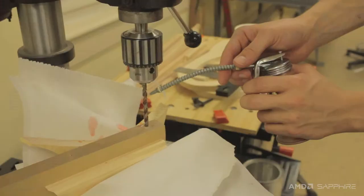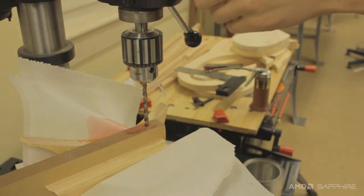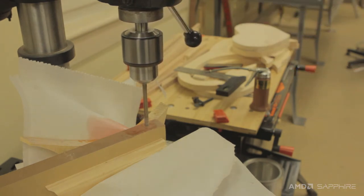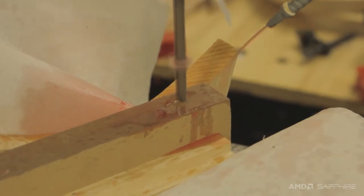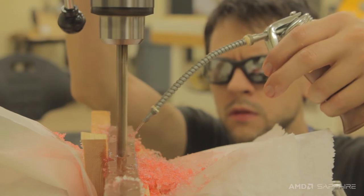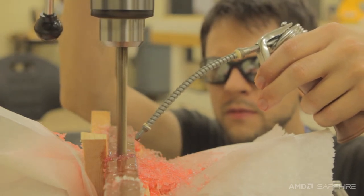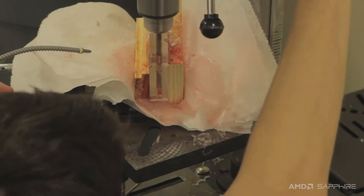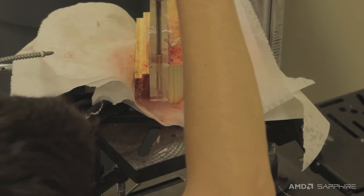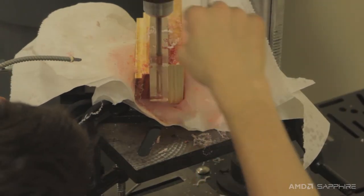Drilling the acrylic was very difficult. I was stressed out over the piece because if it cracks, the mod is done. The cell cast acrylic I'm working with is extremely hard and you can go through drill bits like no other. Even with my cobalt drill bits I had to go real slow and use lots of lubricant — Marvel mystery oil — because without it the acrylic would burn, leaving white swirl marks and potentially permanent damage. I wanted it to be clear and smooth like glass on the inside of the drill hole, kind of magnifying the bolt. Lots of oil kept it cool, kept the bit sharp, and kept the acrylic from cracking.